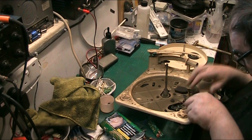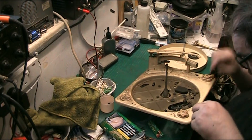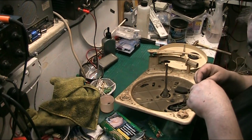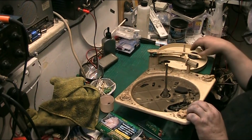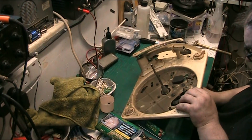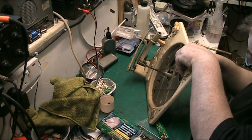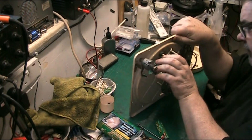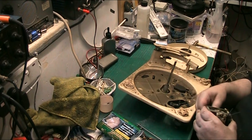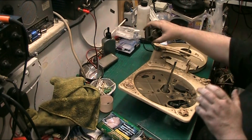This is going to be a pretty in-depth video on this unit. I probably won't take the grommets out because I don't have any replacements. To be honest they don't feel like they've perished. Oh — look at the edge of the idler. His idler is actually not bad, it's still rubbery — that's good. Now let's get the motor out. That's generally a push fit into these grommets and you've got to be careful you don't tear the grommets when you pull the motor out. There we are — managed it. Now that motor's not bad; it's funny how the motors never seize on these things.